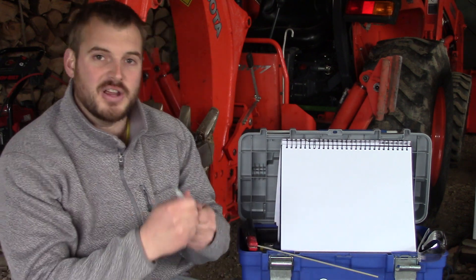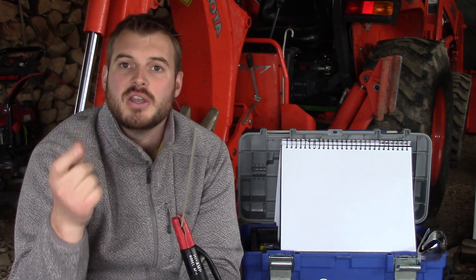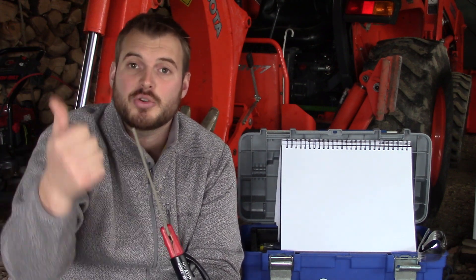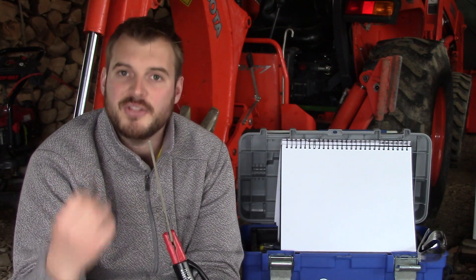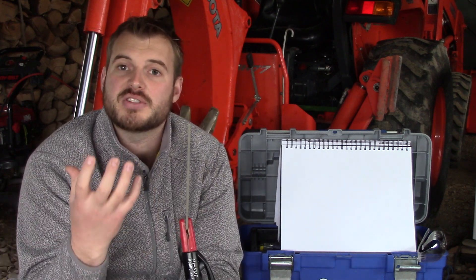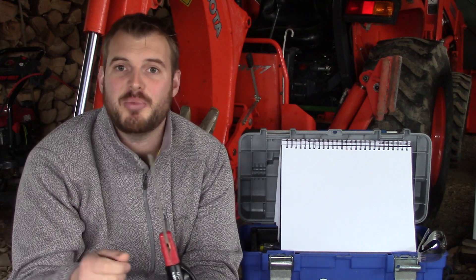What we have here is something called a stinger, or electrode holder, and this is going to have an electrode coming out of the end of it. The electrode serves multiple purposes, but essentially it does three things. Number one is to create heat for your weld. Number two is to melt the filler metal inside of the electrode. Number three is that an electrode carries some type of fluxing agent. What flux does is it removes impurities from a weld. As the weld pool cools, it brings all the deformities to the surface in the form of something called slag. Slag is basically the garbage can for a weld — you take a little hammer, chip off the slag, and the weld is clean.